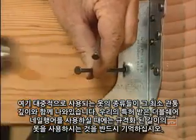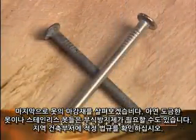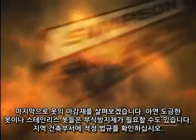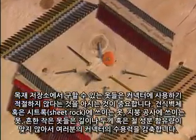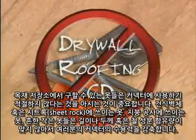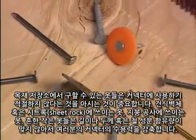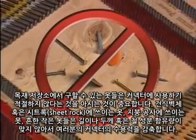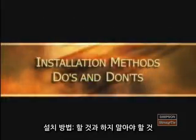Here are some common nail types with their associated minimum penetration lengths. When using our patented double shear nail hangers, you must use the specified full length nails. Finally, consider the finish of the nail. Galvanized or stainless steel nails may be required for corrosion resistance — check with your local building department for specific code requirements. Many nails found in lumber yards are not appropriate for use in connectors, including drywall nails, roofing nails, and small common nails like the six-penny nail. These nails lack the length, thickness, steel composition, or coating needed, and they substantially reduce the load capacity of your connectors. Remember, the incorrect use of fasteners is the single most common mistake made during connector installation.